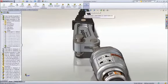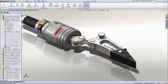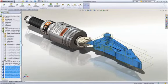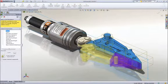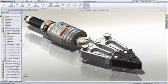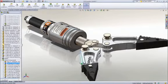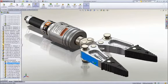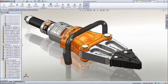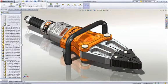Half of the spreader is complete, and we can save assembly time by mirroring the parts about the central plane to the opposite side. SolidWorks allows us to verify and change position of each part, and even to create opposite-hand versions of individual parts. In just 2 minutes, there were 19 parts added to this assembly, and our assembly task is complete. Let's turn on the parts that we have previously hidden and document this assembly.